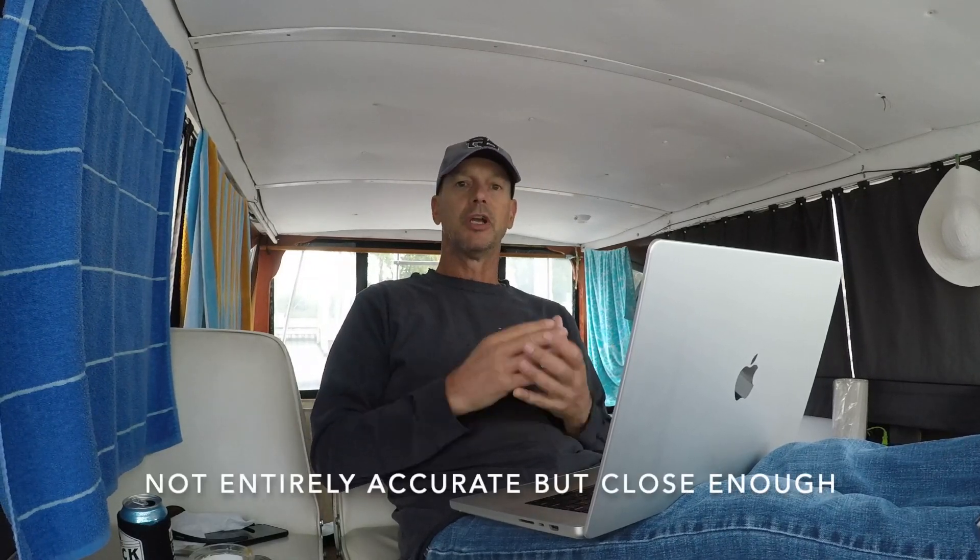I learned the hard way that the Anker solar charge controller flips between two different settings. I found out on Reddit: the 767 will take from 11 volts up to 32 volts at 10 amps max, but if you go above 30 volts all the way to 60, it'll take in 20 amps max. I think the voltage drops just enough over that long wire run that the charge controller stays at 10 amps, limiting how much power comes in.